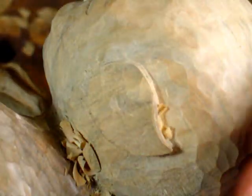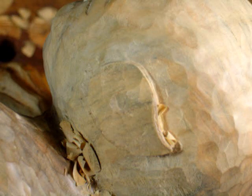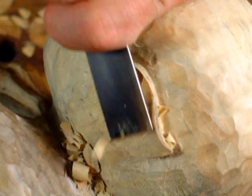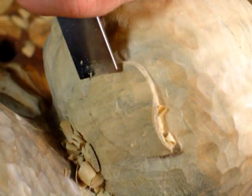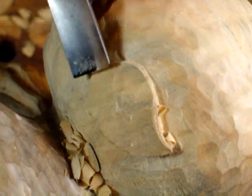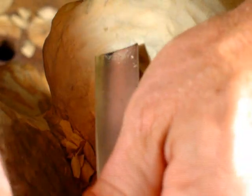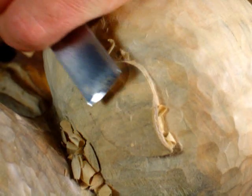I will continue to work this down. I left myself a good bulk on the head so that these features could emerge. I'm going to keep working this ear — this is one of those places I can't carve any wood back on, so I'm going to do it gradually. I think you get away with murder when you're coming into an edge like that. If I was coming this way I'd be a lot more nervous about tear out. Whereas this way I'm pushing into the edge.